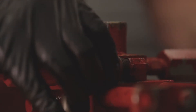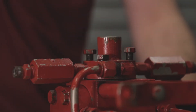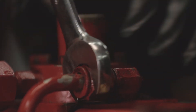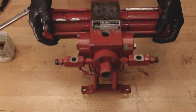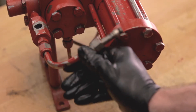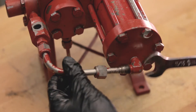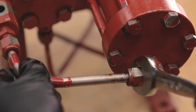Hand start the pilot piston tubing and then bolt down the pilot piston valve housing. Now you can tighten down the pilot piston tubing and then stand the pump up on its legs. Hand start the L-shaped tubing on the needle valve side and use a wrench to move the tubing elbow into position as you push the tubing into place. Tighten the fittings until snug and then repeat these steps for the other side.